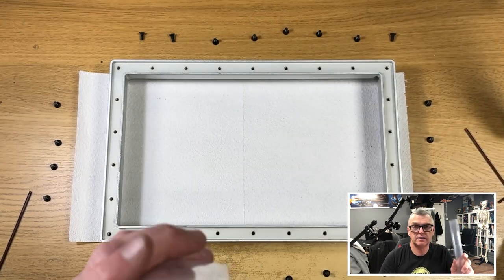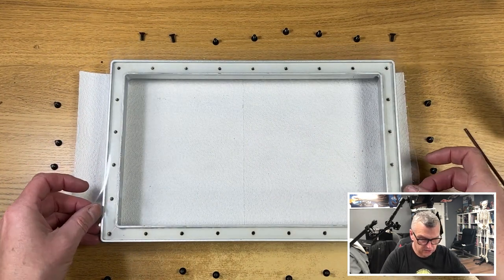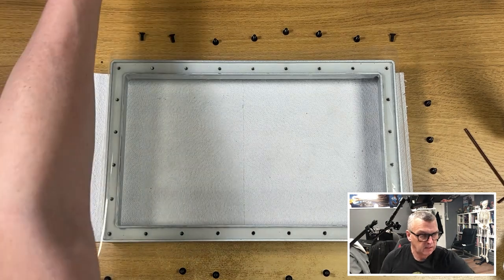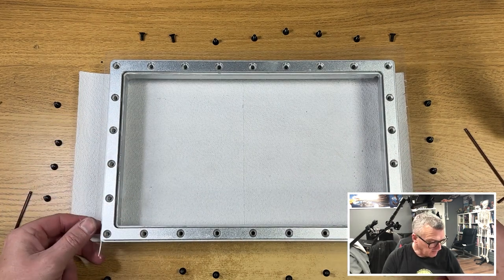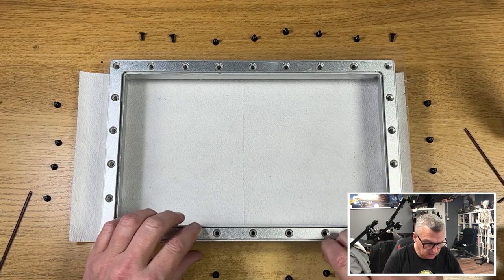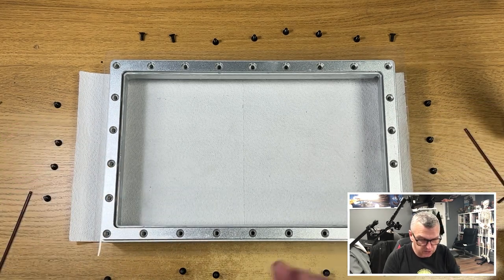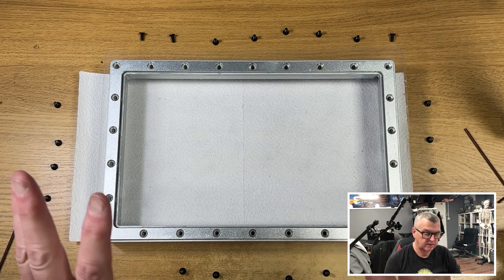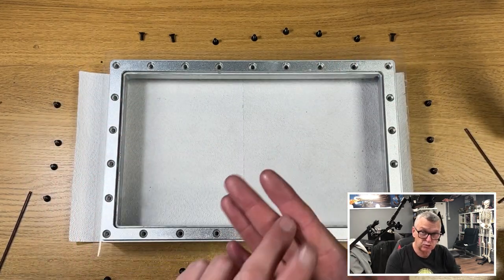Take the roll of FEP and lay it out across the tray. It's going to be loose and floppy, but make sure it extends fully over every edge. Then place the aluminium frame edge and pull it as tight as you can. You can hear there's a bit of tension there already, which means you're on the right track. Then you've got to start fastening the screws back in a very careful sequence so you don't have any looseness or flexibility along any of the edges — it has to be taut and drum-like, or this won't work.